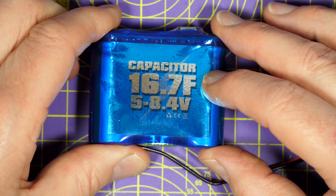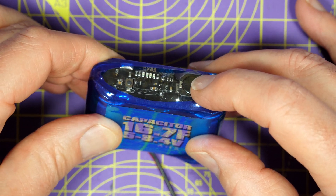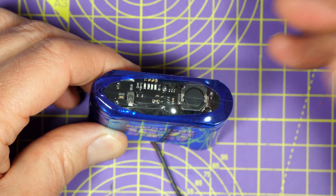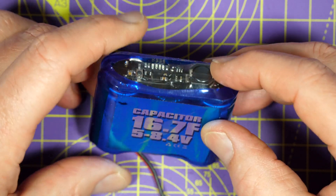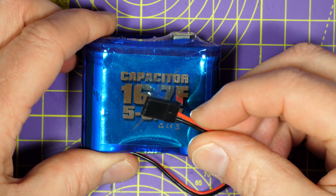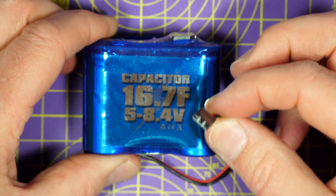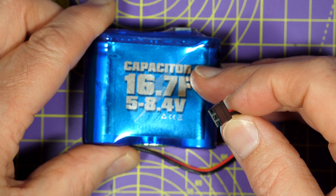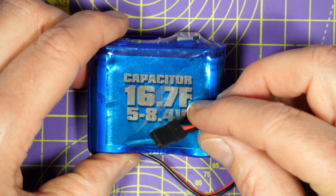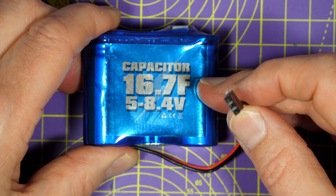This little device from VgoodRC is really aimed at RC helis, but it struck me it could be used on a wing or in fact any electric RC plane, although it's not much use for quads to be honest. The idea is you just plug it into a spare servo slot on your receiver, and if your main battery drains down to the point the BEC can't power the receiver and the servos, you don't just crash and burn. The supercap will keep your receiver and servos powered up for a short period so you can auto-rotate or glide to the ground under control.